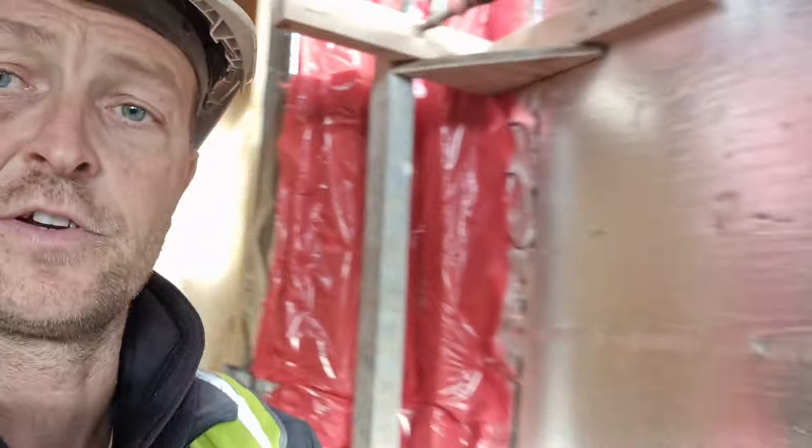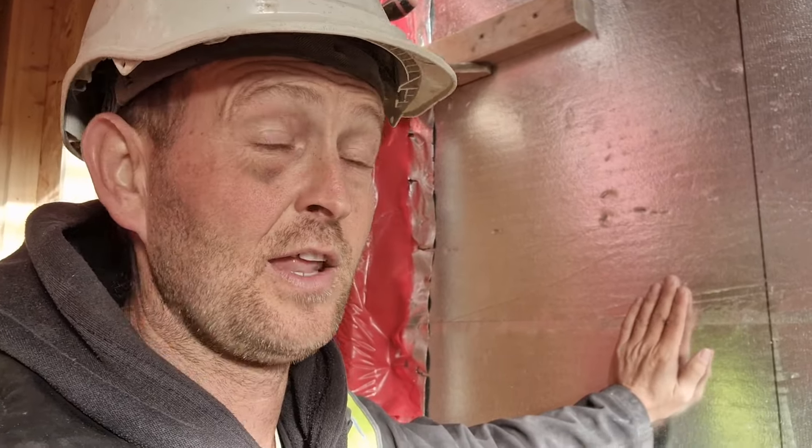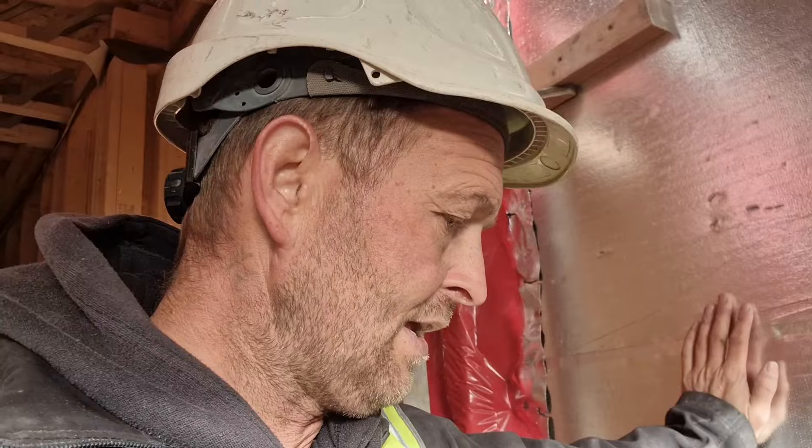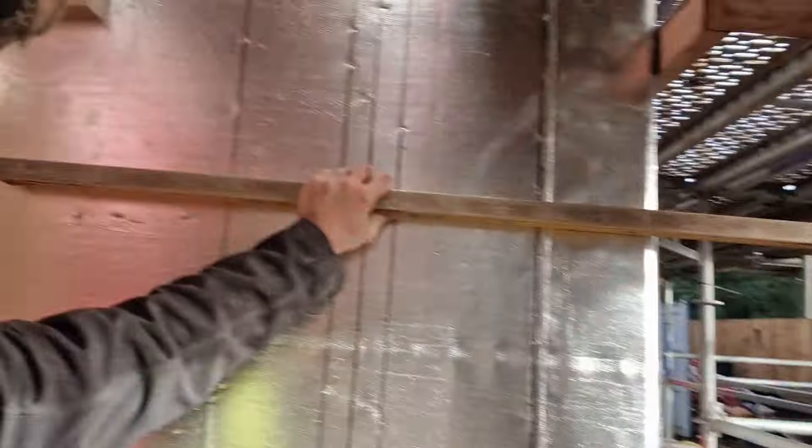There are a few things — a lot of things actually — that you need to set up right to start with, so I'm going to show you a few things just to get you going a bit quicker when you get on the jobs. First thing is when you're setting up, it's irrelevant where you want to put your brickwork because the timber frame is already up, so you're governed by it. Whatever the cavity size says, that's what you go to — unless it's stupidly out, and then you need to tell the site manager. Once the building is up — and this building is up, it's a big apartment block — you go to that. So what we're going to do is range off this with a level, come off your board, and set your profile out to whatever the cavity is to suit it.